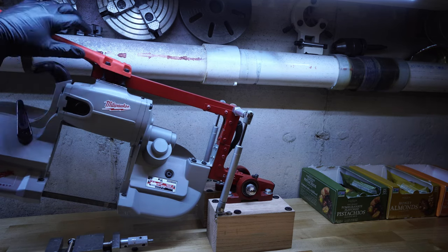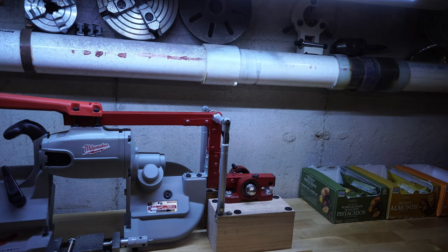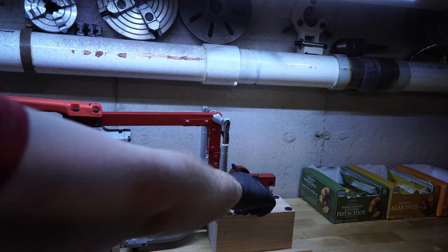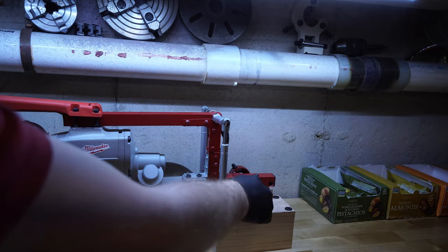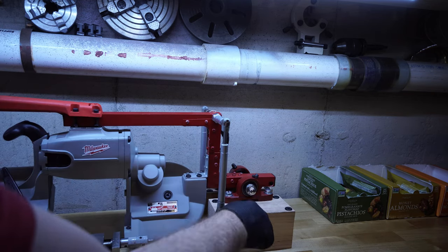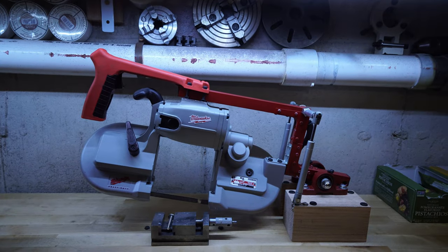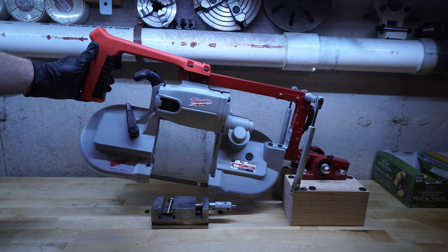The trick is to build the Z arm, mount the bandsaw to it, and then figure out how high you need to elevate it so that when it is flat, it's level with whatever base you're working on. So if it's a tabletop or bench, you want this blade to be parallel to the bench when you put it down at the bottom. You want enough height supporting the pillow bearings that the whole thing is parallel to the bench. For my setup, four inches worked out nicely.